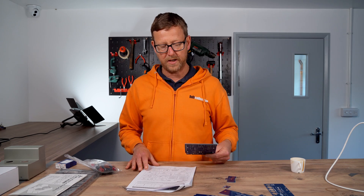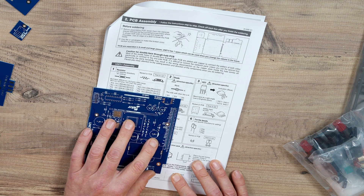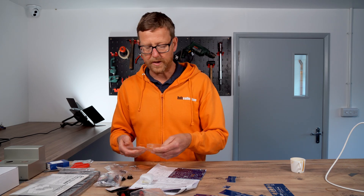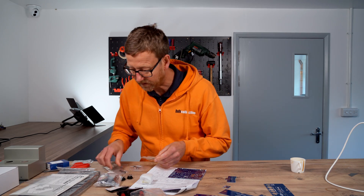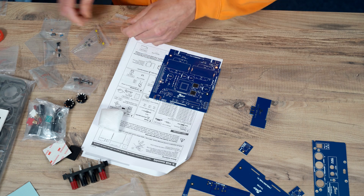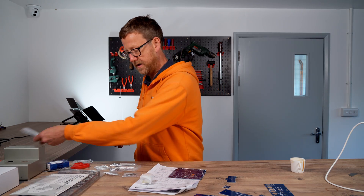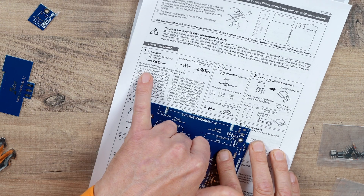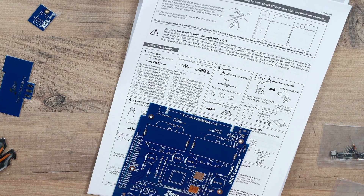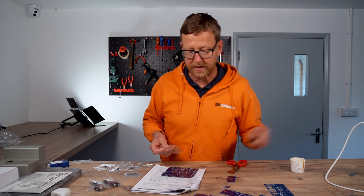When they detail the list of resistors, they put the color codes on as well, so it's always good to reference that. One of the good things is they don't mix resistors in a bag, as far as I can see — but they are unlabeled, so you need to use your color code. First one on the list is 2K2, R19 — obviously red, red. As I'm building, I like to tick them off.